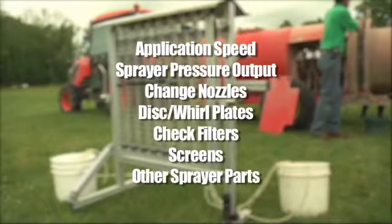This may require adjustments in your application speed or sprayer pressure output. Or it could be that changes are necessary to your nozzles and/or disc whirl plates. You may need to check filters, screens, or other parts of sprayer equipment.